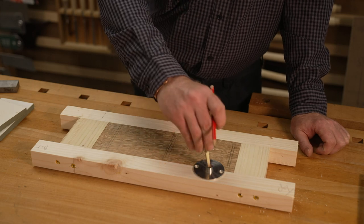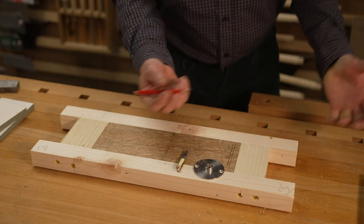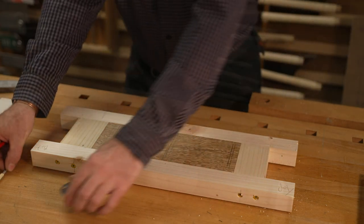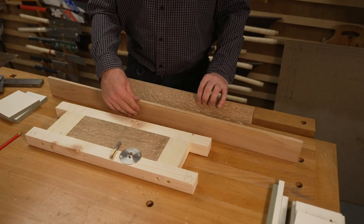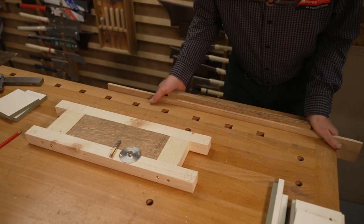So the cutter, first of all, needs to fit down through the middle of the guide bush. That's important to check. So 10mm, 14, 4mm difference. That's 2mm either side, if you centralise your cutter. Some advice, all I'm going to use is a couple of spacers. So a bit of cherry, this is 9-10mm thick. Doesn't have to be anything specific. I just want that there for a minute.